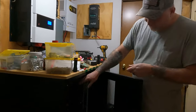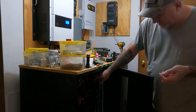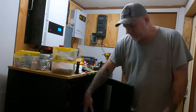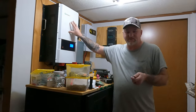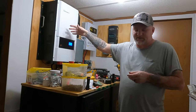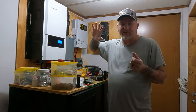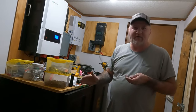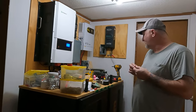Like I was saying, these are 24-volt batteries in a 48-volt system, so I take two batteries and make a 48-volt battery by wiring them in series — negative to positive — and then you have a positive lead and a negative lead left, giving you 48 volts. The purpose behind buying 24-volt is that if something happens — a grid-down situation — I have a couple of 24-volt inverters I can swap in. If they ever come out with something this large in 24-volt, I'm going back, because I like the way it charges better. A lot of people won't agree with that, but I really don't care.